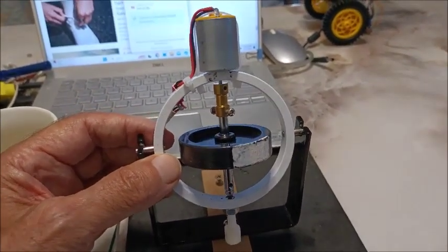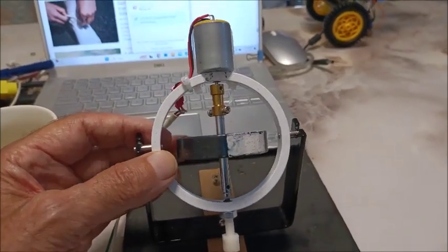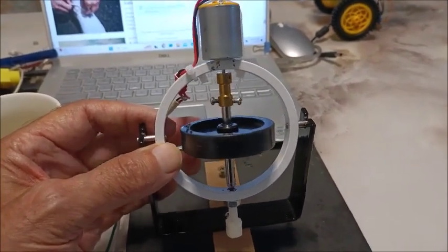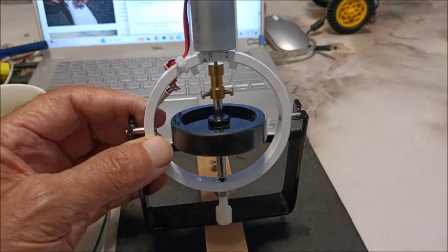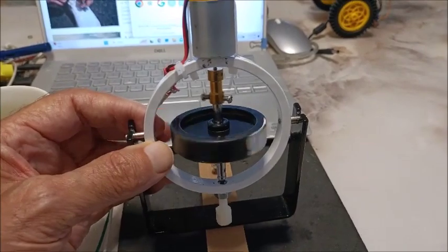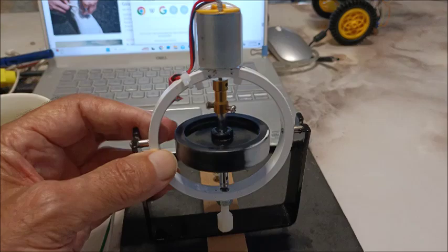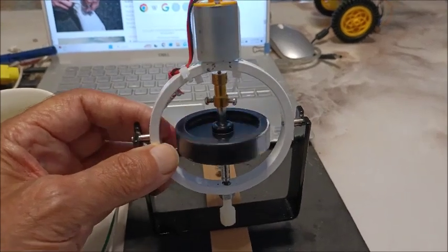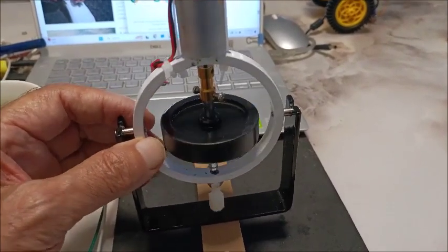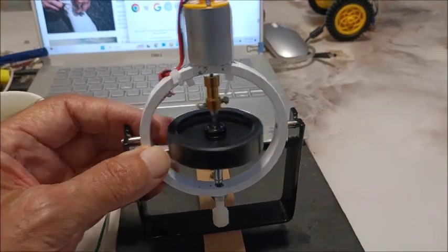Next time I try something like this, I'm going to have to buy a more expensive one. It needs a big rotor — a thick, heavy rotor like this one, but with a bigger diameter. If you double the diameter, you get 4 times the inertia. If you double the speed, you only get 2 times. So the best way to increase the effectiveness of a rotor is to double or increase the diameter.